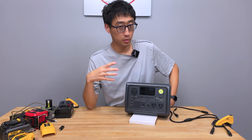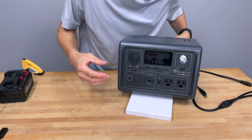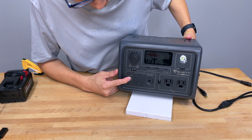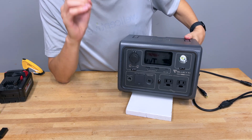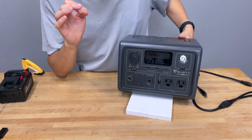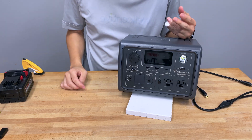Because this has a 200 watt solar input, if you want to use it all day you can only really draw a maximum of 200 watts. The MPPT controller input range says 12 to 28 volts DC and maximum 8.5 amps - so whatever combination you use to get to 200 watts, that's what you want. That's great news because most power tool batteries on the market - at least the biggest platform ones - are running on 18 volts, though there are also 12 volt, 24 volt, 36 volt, and 60 volt options.